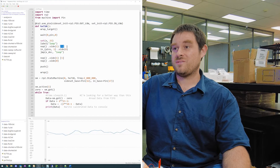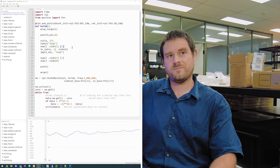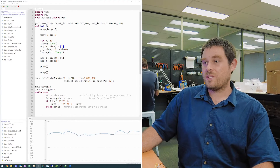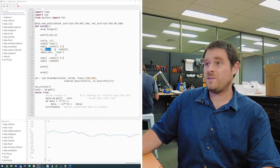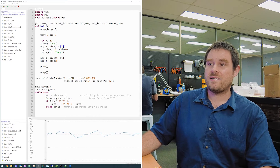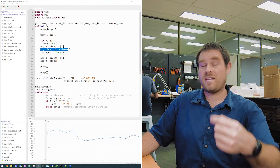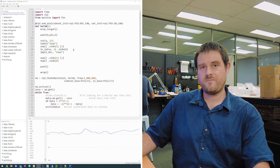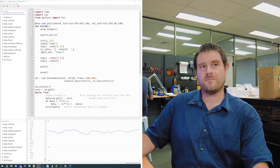A NOP instruction does nothing except affect the state of the side set pin, and the delay syntax adds an additional clock cycle. In the input instruction, this reads a single bit from the input base pin and sets the side set base pin to zero at the same time. Data changes on the rising clock edge so we can't read it then, but on the falling clock edge we can. Across those two lines you have a full clock cycle — a rising edge and then a falling edge — with frequency set by the state machine.